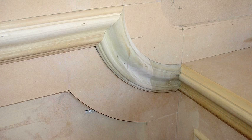That's right. Now this piece right here is hand turned. It's not cut with a machine. So you can see a slight discrepancy, which is really just in the turning. But other than that, this radius is correct to make the profiles line up. And there's the piece back in on the wall again. Yeah, so here it's installed, and then here you can see the chair rail will wrap around a pedestal.